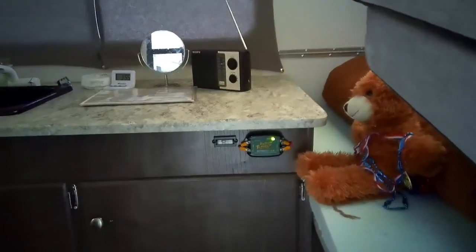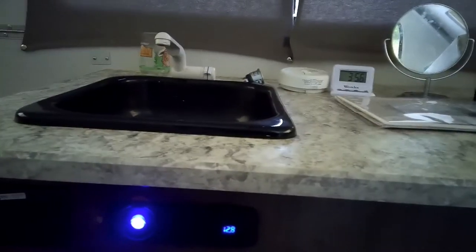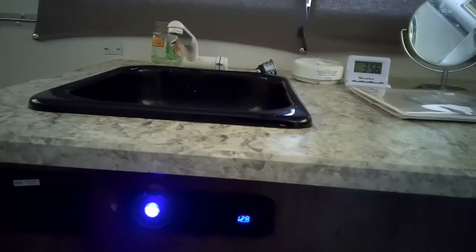I think you can see the little green light there. That means that my solar panel has charged the battery. It was 13.5 when it showed. It's 12.9 now — it holds it around 13 volts. When the sun's really out it'll bring it up to 13.5, but it's holding 12.8, 12.9, and it's still charging.